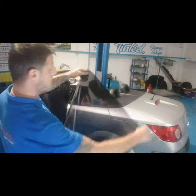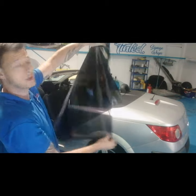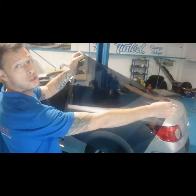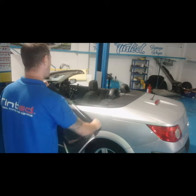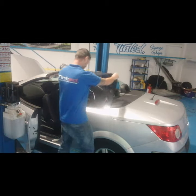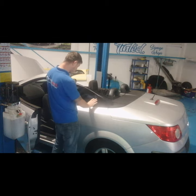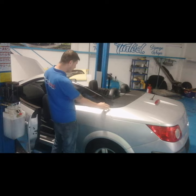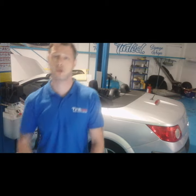You're going to grab your window film, which I've already cut. The factory edge has to be at the top and the bottom, so you can't have it the other way. The liner has to be facing you, so the glue has to be facing you. We're going to put it on this window here. Our rubber strip is straight, so we can just line that up straight to the bottom, which is great. But if it was curved, we'd have to bring it down and cut it to the shape of the rubber.